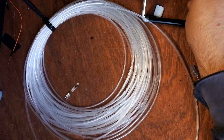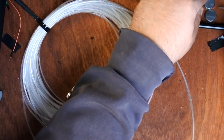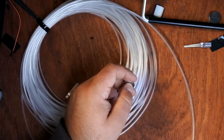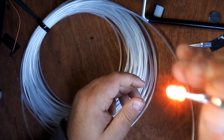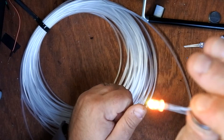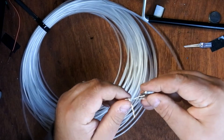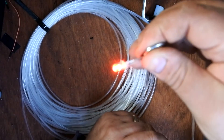For testing purposes I use these little button cells because you can connect them directly up to the LEDs without damaging them — there's not enough current. I buy them for a euro for eight. With all the LED legs connected it comes out as a greeny-red, so they're cheap LEDs — you're not going to get pure white. I don't want the green leg, so I'm going to bend that one back, and that should give me blue and red, which gives a kind of purpley-pink. It doesn't really show up on camera but it'll do the job.